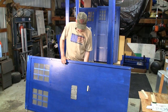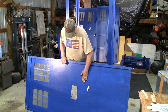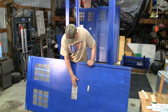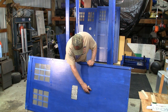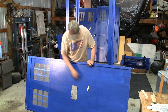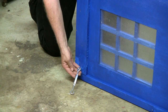Once we had the front dried, we removed all the screws holding in the stripping, then filled them in with wood putty and sanded for a nice clean look. On this particular wall is where the monitor mounts. This plate replicates the plate the monitor sits on its stand. A small patch is covered with Velcro — this is where wires will go out of the side wall. On top of each corner of the walls are eyelets with a turnbuckle, which will provide stability when we assemble the box.